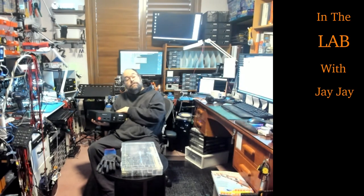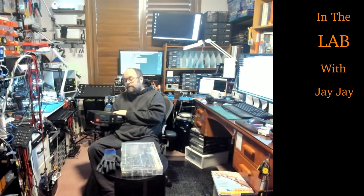I found evidence of a lot of leaking capacitors. I recapped the power cap, so I put in 5 new capacitors. I redid the thermal paste, and that went pretty well. But when I turned him all back on and plugged him all in, after the operation, no power, just nothing. It wasn't flashing, it didn't open, nothing happened. Which makes me suspect the power board or something to do with the power circuitry. It all looked okay to me on face value, so obviously there's some problem there.